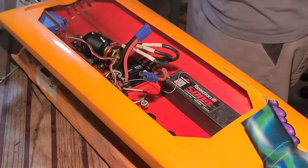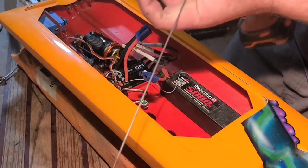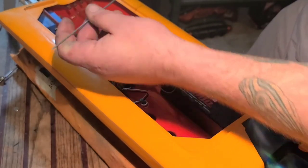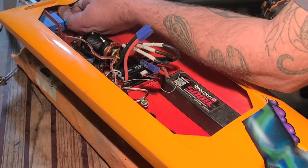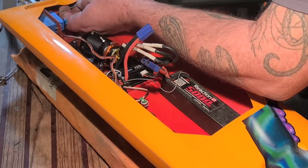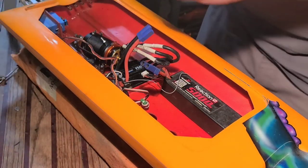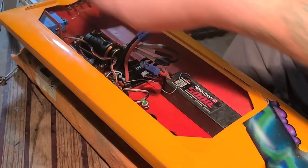The other one. So I'm gonna show you a little trick here. I got a tight place to drill a little hole, and it wasn't quite big enough for that other screw. I actually use the push rod, and I can bend it into a tight corner and give it some juice. See if it'll drill this hole out for us. Thanks, Pops. Learn a trick every day.